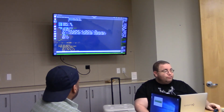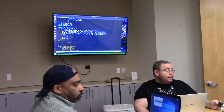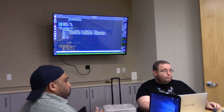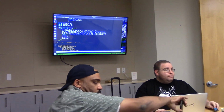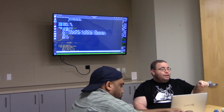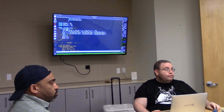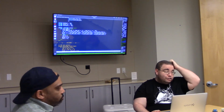Now, I don't have to make this a register. I could do that same assign thing that I showed you before, a continuous assignment. And then as VGA column and row change, the VRAM address bus would just magically change along with it. And because this is async RAM, that would work. As long as that read pin is low, however the address pins change, the output pins will change accordingly. The data pins on output are not latched with a clock.